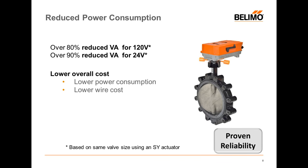Another big request was to reduce power. This new actuator uses 80% less power at 120 volts, and over 90% less at 24 volts. It's also a universal power supply that can handle 240 volts at around 82% savings. So you have one actuator that can handle all voltages, reducing the number of pieces on the shelf. With lower consumption, you don't need as many transformers, saving space at the job site, and you also lower wire cost because you don't need as high power.